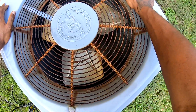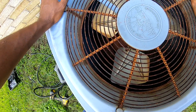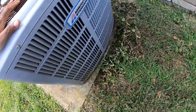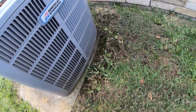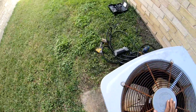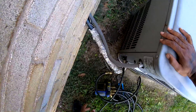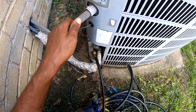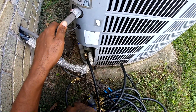The house has been vacant until this tenant came in, so I don't know if it was low before or what's going on with it. I'm about to weigh my options here. Since it's a '94 or '95 — 25-plus years old — I need to see if he just wants to upgrade it or go ahead and charge it up and see what it'll do. He hit me up about six months ago wanting a quote on replacing this unit anyway, so I think it's about time. But I can't pinpoint that leak without pulling that coil or pressurizing with nitrogen, and I don't want to do that.